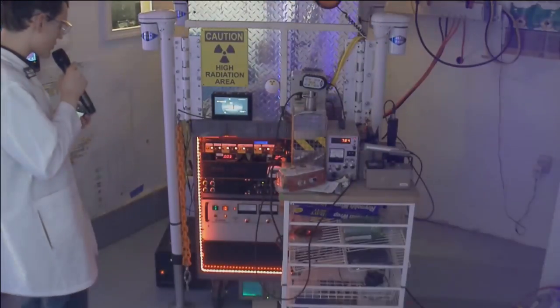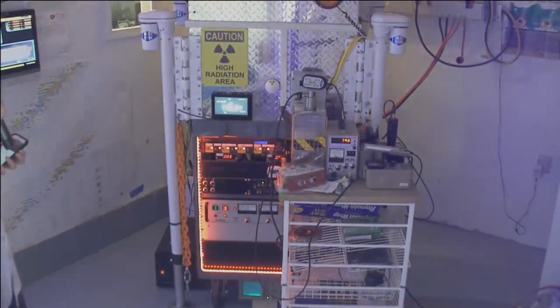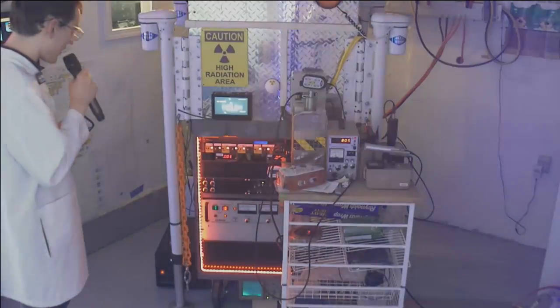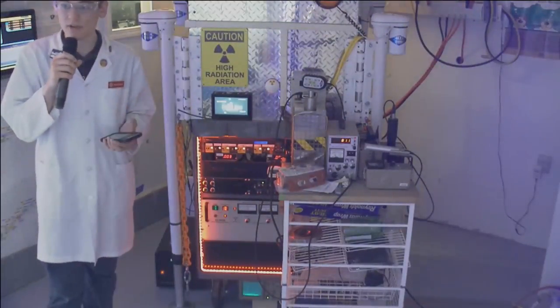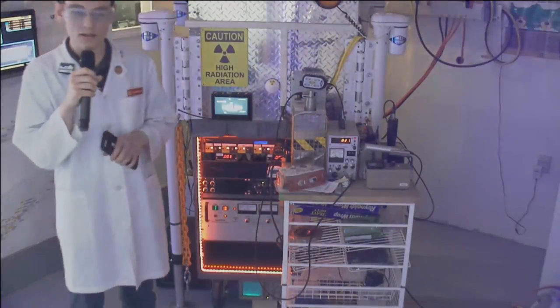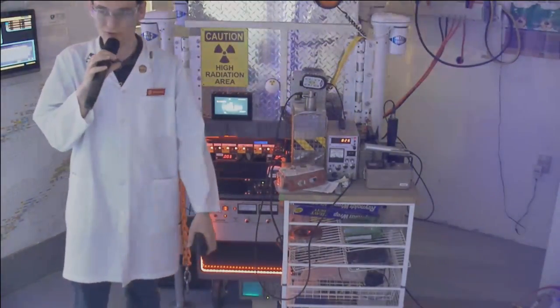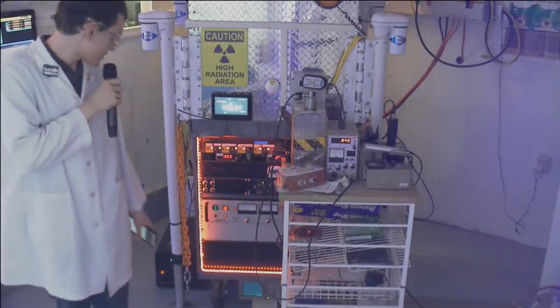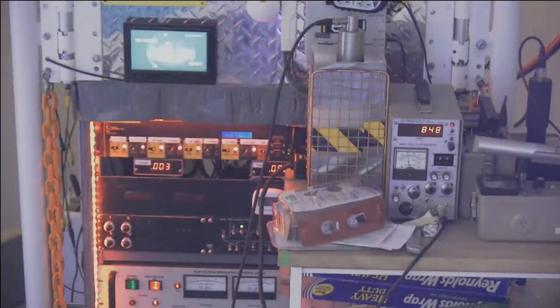How long can this run reliably after setup? With the constant current, constant voltage supply, this thing can go a really, really long time on its own. It's designed to be very stable. It's designed to be easy to run. There's only a couple of control knobs that do it. And we literally just started warming the diffusion pump up before the stream, so we're not running at full vacuum pressure, which is part of what was giving us some issues. And the machine being started up can be a little bit cranky right now.